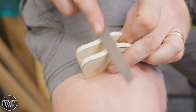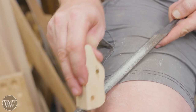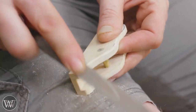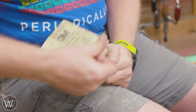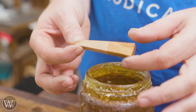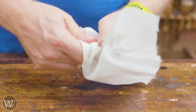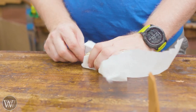After this it's all about the finishing, the detail, the smoothing. It's a functional plane - you don't need anything more. But as humans we like things to be pretty, so we're going to do the rest with files and rasps, clean it up, smooth the edges. I could put chamfers on it, I could put indents for the fingers and try all sorts of little things. This is the point where you can get creative and experiment. This only took an hour or two to put together, and if I don't really like it I could make a whole other one. I'm going to hit everything with 400-grit sandpaper - this kind of clogs the pores and will actually pull the boiled linseed oil a little deeper into it.